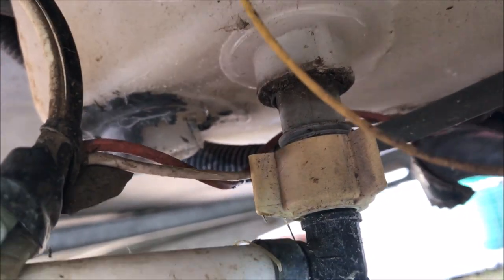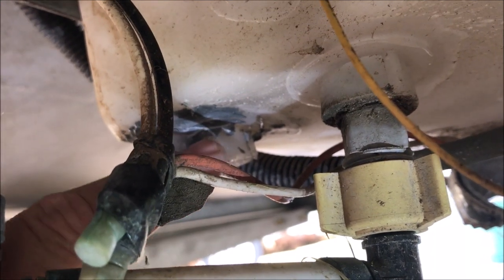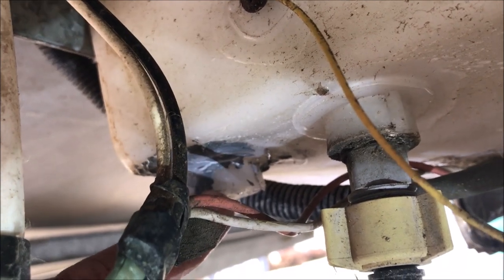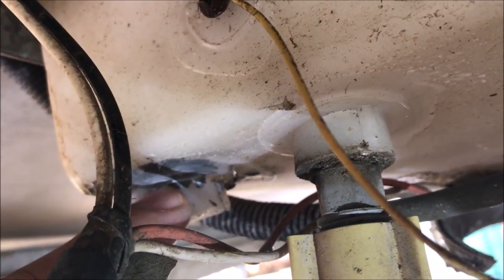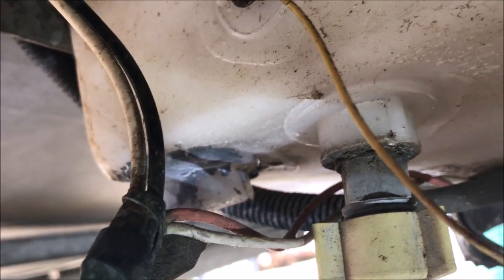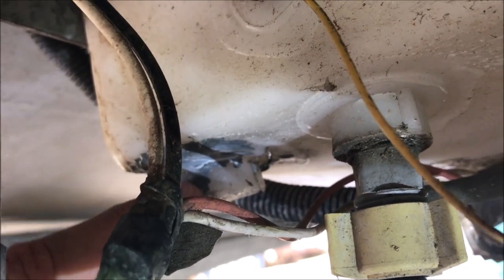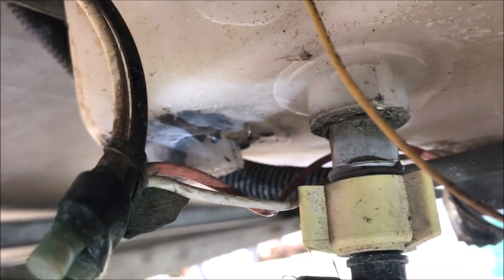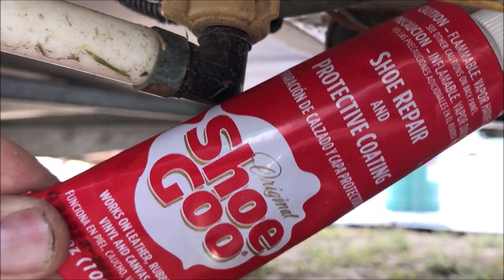As I took this thing apart, what I found is the plug did come out. I just cut the JB Weld a little bit and it's actually cracked right where this bung goes to the body of it. Now as I'm using a wire brush and my knife to get the JB Weld off, it's just flaking off, which tells me it didn't have a very good bond to that particular type of plastic anyway. I'm going to keep scraping with the knife and wire brush, get this down to just the plastic, rough it up some more, and then break out the Shoe Goo.